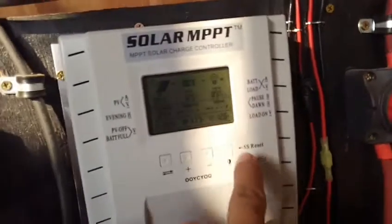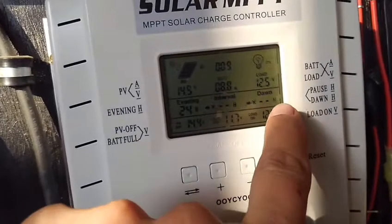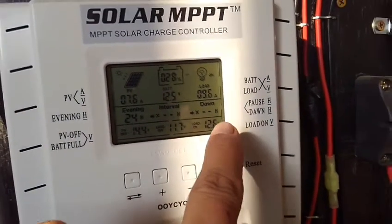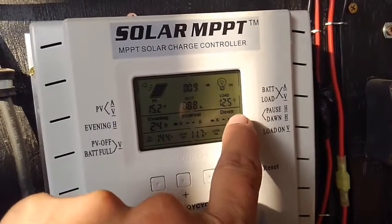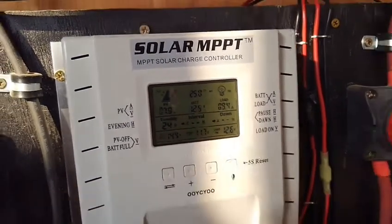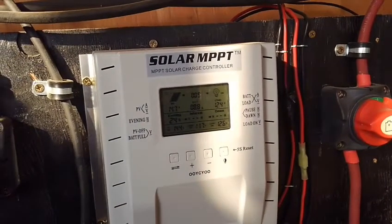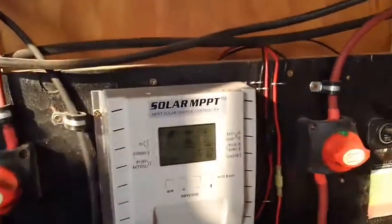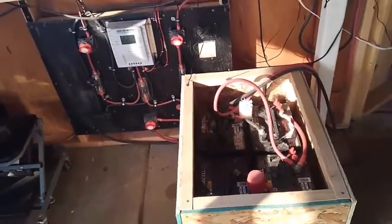Now with both of these going and the pump going, I'll show you how many amps and watts it's using. I've hooked up to my load right here on my solar charger and this tells me my load is 9.6 amps — so about 10 amps rounded up — at 12.5 volts. So let's say 10 times 12 volts: 120 watts. It's only using 120 watts; it was using 500 watts before. That's a big difference, and it can be run completely off grid on my battery bank 24/7.